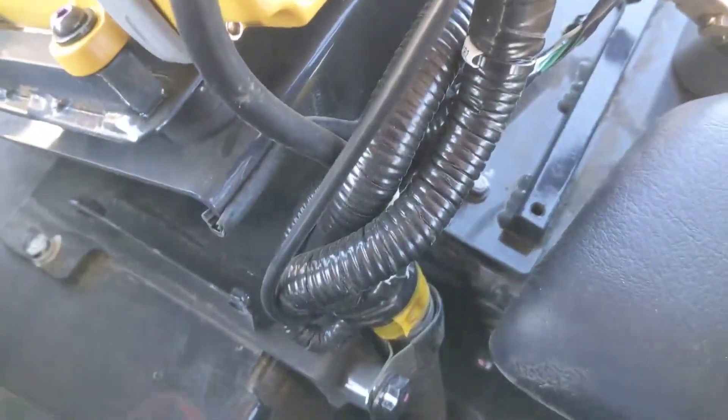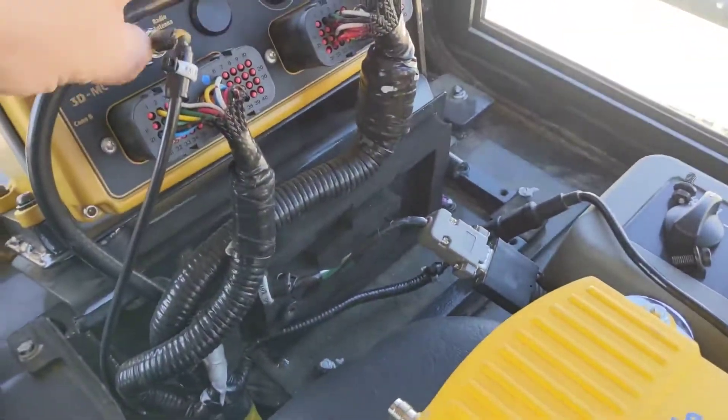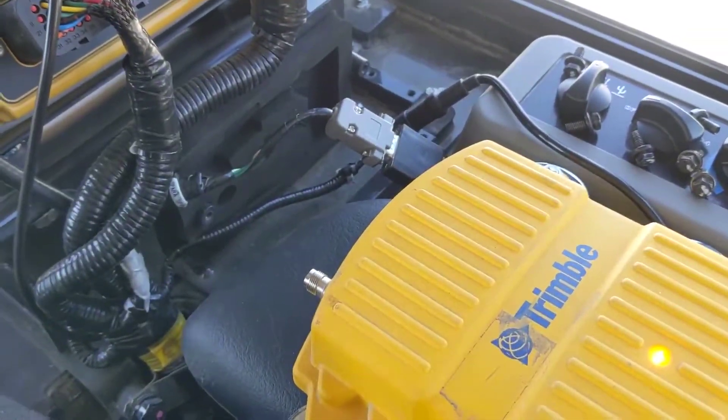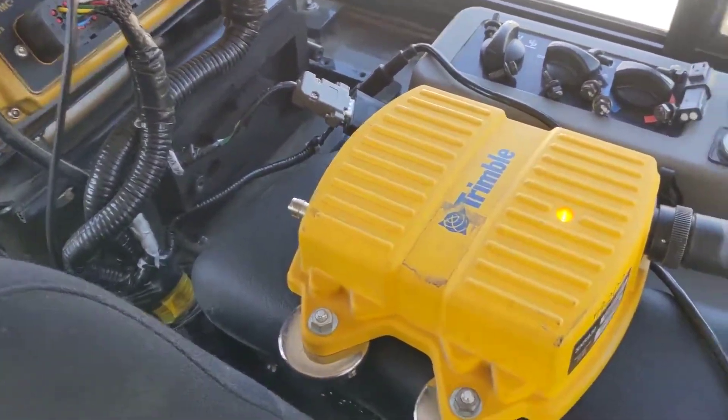Western States also has a cable — you can remove this connection right here, which is our antenna. This antenna on the iMachines runs outside to the top of the cab. If you've got a 915 Topcon antenna on there, you can get a cable — I'll put the part number in the description — that connects from the top of your radio onto this, so you can have an external antenna and keep the radio inside out of the weather.